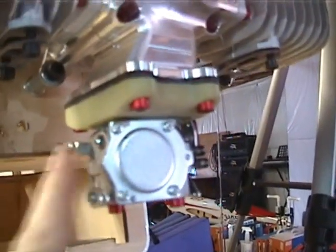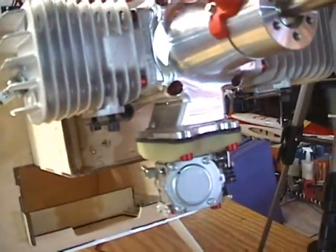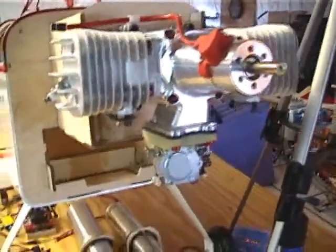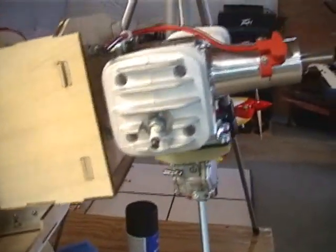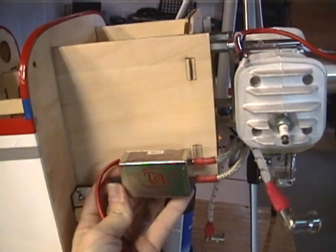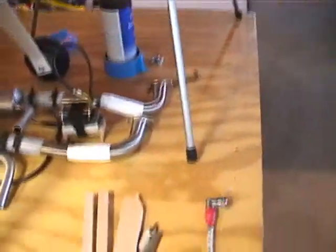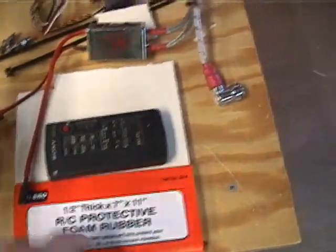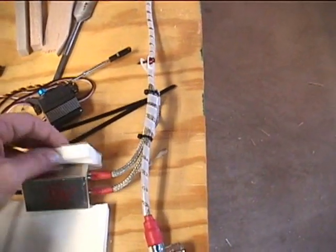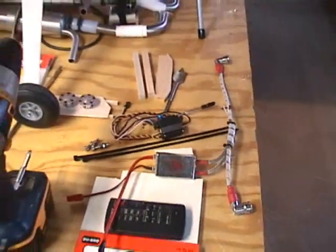It comes straight through the firewall. Now the fuel line — you've got this nipple coming off the carburetor and I just went line of sight. The fuel line's flexible, so it'll go through there without a problem. This is also a good time to drill your holes for your ignition box. I'm going to be mounting mine on the side here. It's important when you're mounting these to use protective foam rubber — it is prone to vibration, so you want to isolate that. Then I secure it with a couple zip ties right to the side of the engine box.